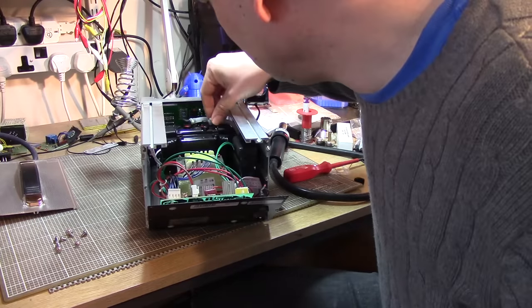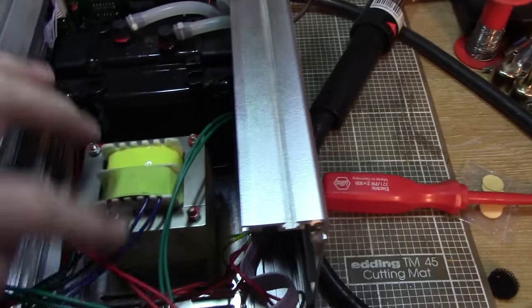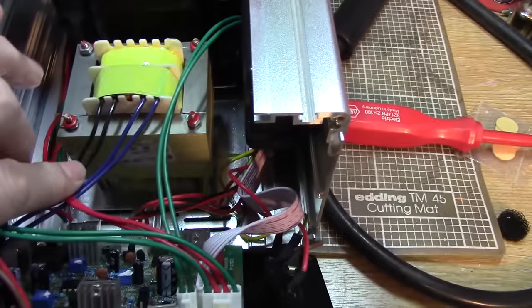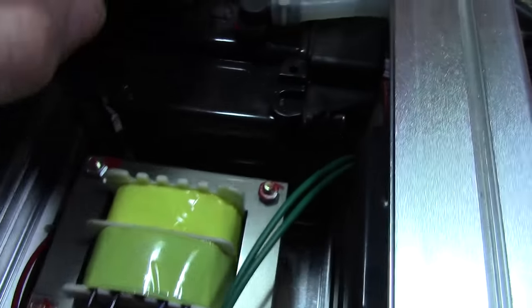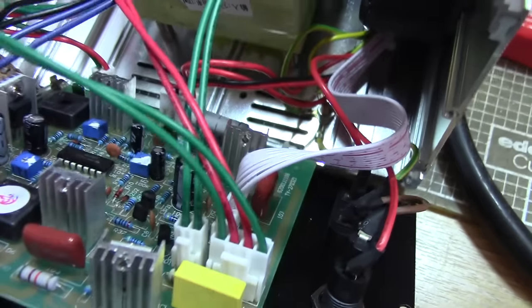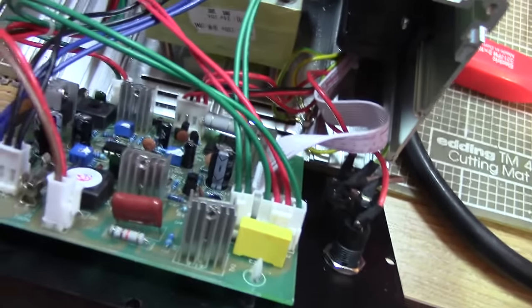OK, we're in. That's actually quite nice. Let me go handheld and have a look. So on the inside we've got a fairly chunky transformer giving us 24V and 10V taps. We've got our hot air gun in round there - that's the power going to the hot air gun. We've got this black thing on the side here - I wonder if that's actually a carbon filter. This is obviously the actual compressor pump, and they've done quite a good job - I'm quite pleased to see it mounted on rubber vibration-absorbing dampers at the bottom. That's quite nice. We've got the display and all the logic at the back, a decent chunk of power supply board, and lots of FETs presumably with heatsinks on the back - that will be switching the power for the desolder gun, soldering iron, and hot air gun.